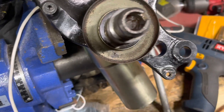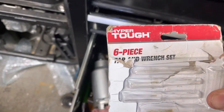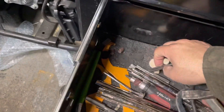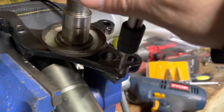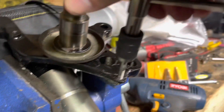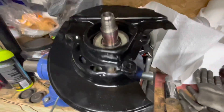This hole here wasn't properly finished. So what I'm doing right now is I had to tap it using Harbor Freight bits, and then I'm going to use one of these tools — it's a tap and wrench set. I confirmed with Victor that it was definitely a raw piece and possibly they didn't get all the shavings out. He's going to be keeping closer tabs on his quality control before sending out these components. The bolts are all in — I tapped it. I'm going to use some Loctite on this one. We're good to go.